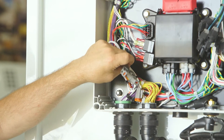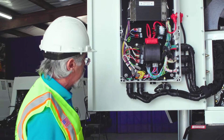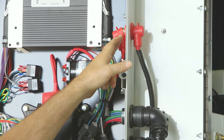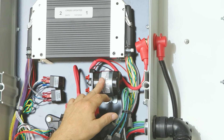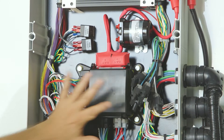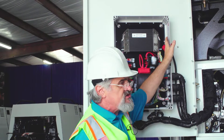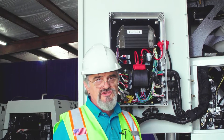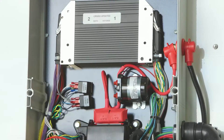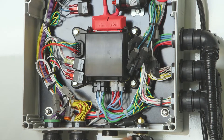The two communication lines connect the controller to the console inside the cab of the truck. Power from the battery comes directly into the outside of the isolator, and from the inside of the isolator goes directly into the main power relay. The main power relay then powers the MVC, which powers everything else in the system. Between the battery and the isolator there is an 80-amp breaker to protect the system from any short. All grounds from the system come to the ground isolator on both the inside and outside.